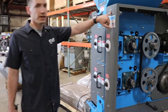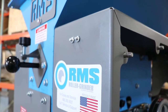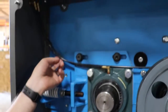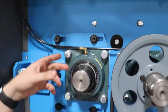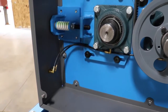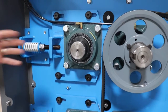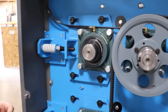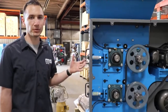Also on the front here you'll see we've got these grease zerks where you can put any standard grease gun on, and from there there are grease lines that bring the grease into the bearings, which are really the main parts that you're trying to keep lubricated. These are self-purging bearings so you can't over-grease them. If you pump them full of grease you might end up with a mess with grease all over the place, but you won't damage the bearing. Recommend that you reference your manual to make sure that you are using the proper grease.